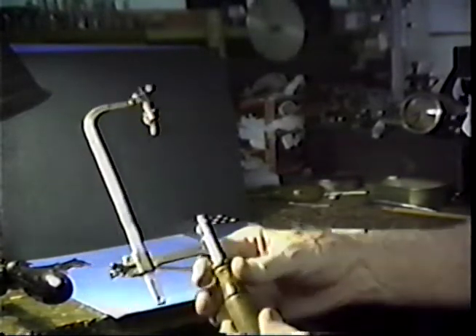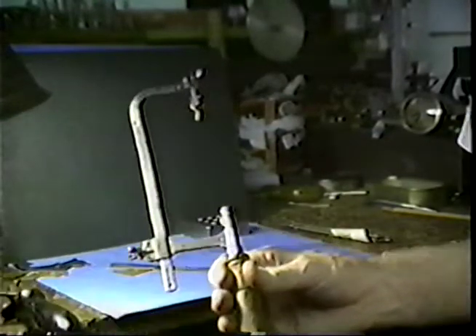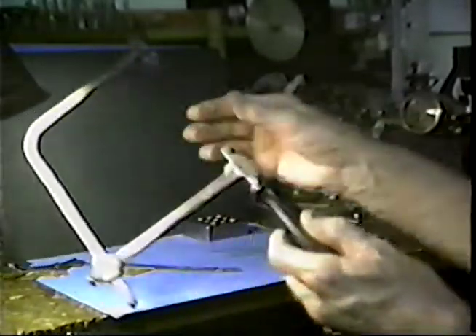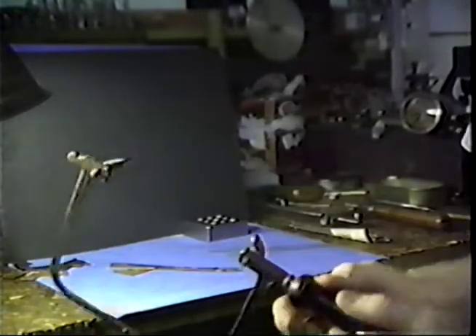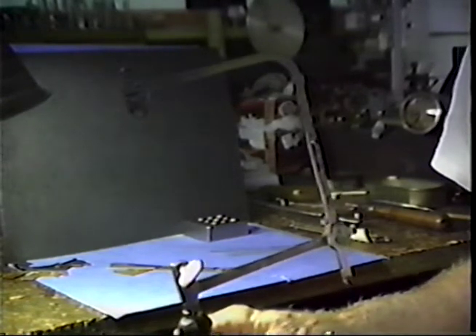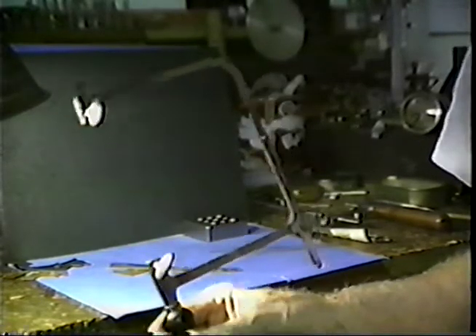This is the smallest frame I have. I wish I could locate one approximately an inch deep. This is the deepest frame I have, and a couple of sizes in between. I would recommend to the young clockmaker that you buy a frame about this depth. If you look at this frame, you can see I can flex it. When I am making the back stroke, if there is a bind in the blade, it slacks the blade, and that usually results in kinking it in the tooth area — in the gullet of the tooth — and the blade breaks. This is the maximum blade breaker in a saw frame.